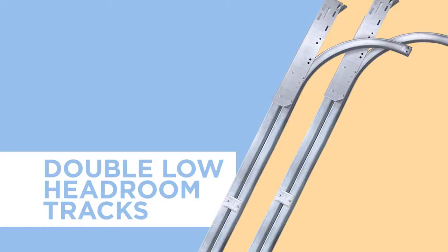So what can you do if you do not have enough headroom in the garage? There are several options available to help with the installation of a garage door in these types of applications. The most common on new installations is double low headroom tracks. These have a second set of horizontal tracks that only the top roller travels through, which causes the top section to flip through the radius quicker, giving more space between the door and the ceiling.